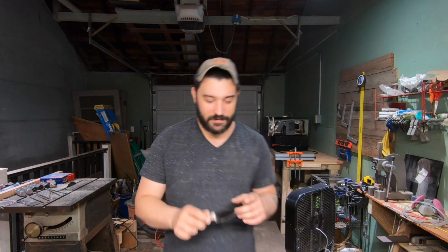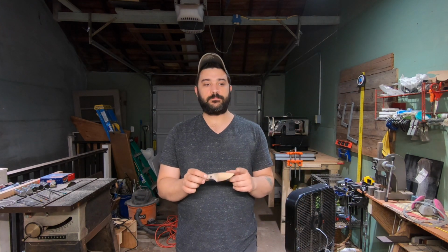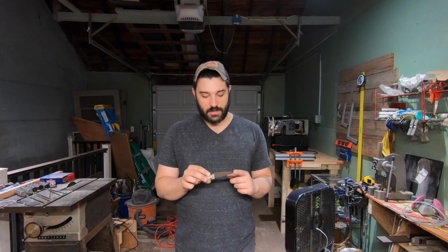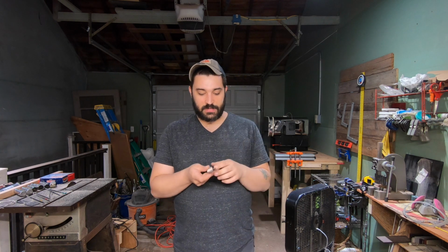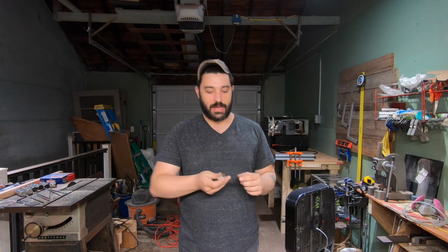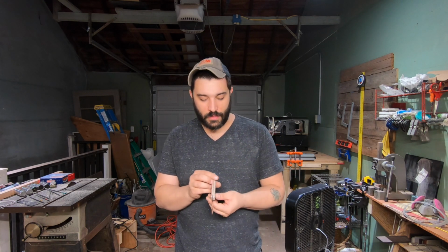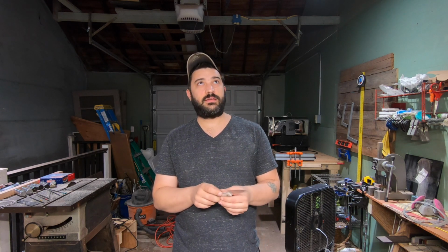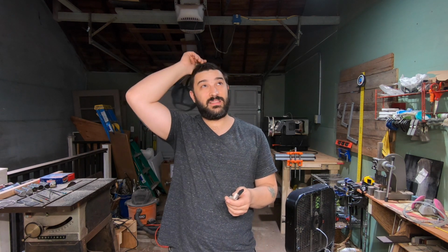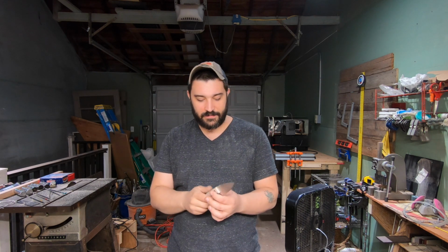But I do have this knife at 63 HRC, a solid 63 HRC. And so I'm going to test it. I did sharpen it on DMT Coarse, DMT Fine. I did 4 sharpenings, so they did 1 right before I came out. We are at 11 thousandths behind the edge. It's a very thin knife. The stock thickness is about, I think, 93 thousandths total stock thickness. So it's a very thin knife.